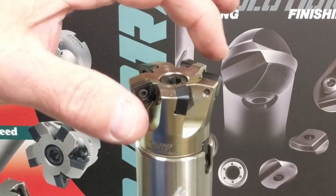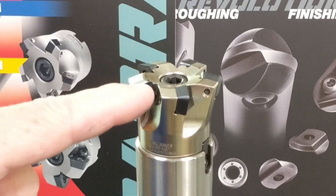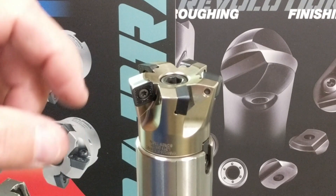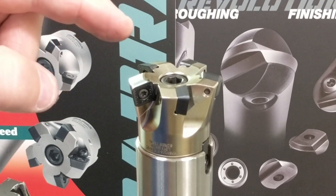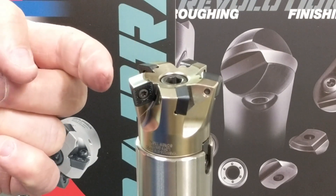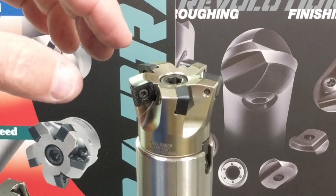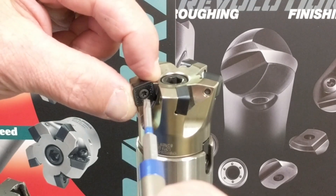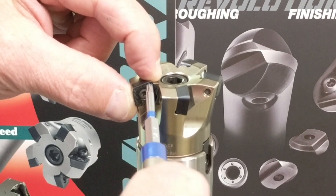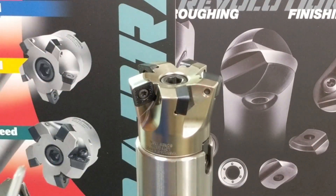Assuming we've taken these steps on all five flutes, here's a summary: clean out your torx recess and blow everything out to make sure there's no residual debris; unscrew your screws; clean your insert sides and insert bottom; blow out your pocket walls and pocket floors; visually inspect for any damage or debris; then reassemble holding the insert in place, tightening the screw at least until the head makes contact with your countersink, at which point you can release the insert and fully tighten. Now you have your cutter indexed to new edges and you're ready to go.